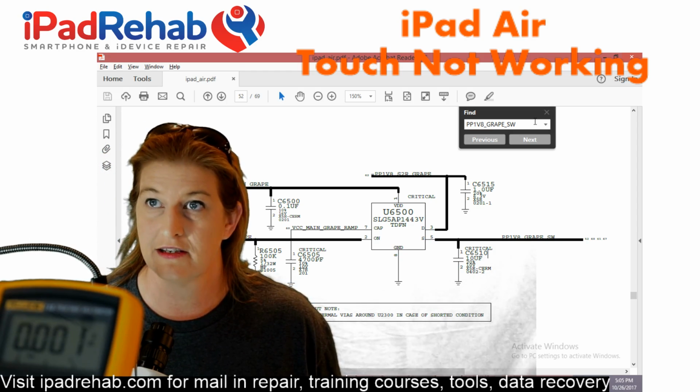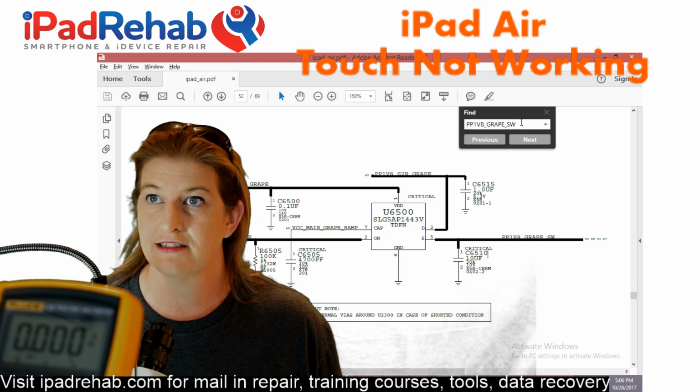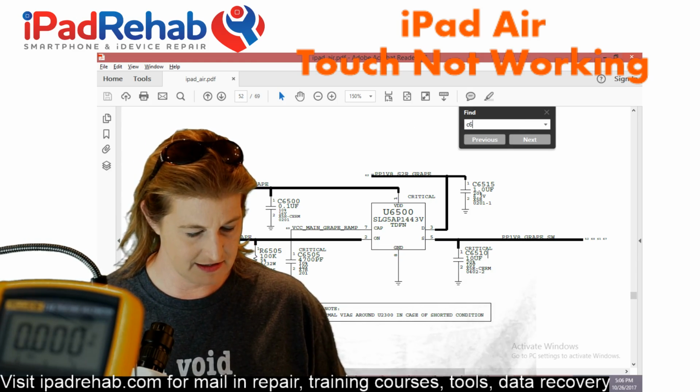All right, so let's look up. Where is C6515? Tell us, dear schematic. Where is it? All right, and it says C6515 is over here. So this stupid red is annoying. Let's see if we can get rid of it, so that we can see. All right, so this is our chip, and we were just here. We just measured the inside of C6510, and now we're going to measure. Hey, here's all of our buddies from our list. C6515, that's one of the guys from our list.